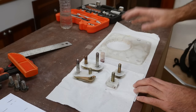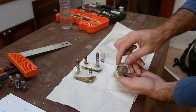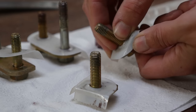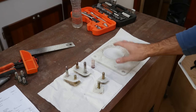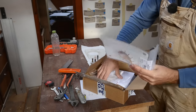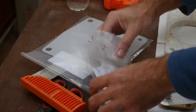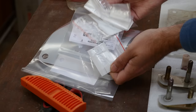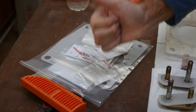I believe one of these plastic pieces is the culprit. It might be something as simple as this metal washer being turned the wrong way around over this plastic washer, or something as simple as this tear in the other plastic washer. I'm hoping replacing all of these plastic parts is going to solve the issue. Volvo was not super expensive with their spare parts — this little pile of plastic represents about 50 dollars worth of parts, which is certainly not dirt cheap, but if it fixes the issue I will be thoroughly pleased.